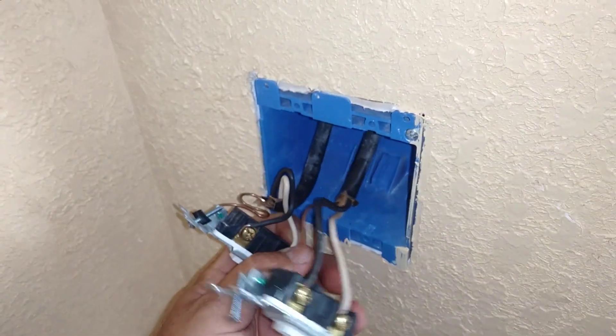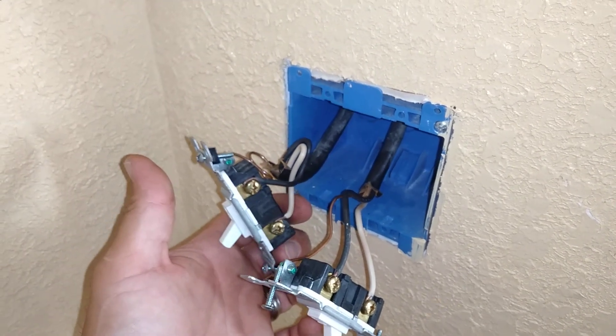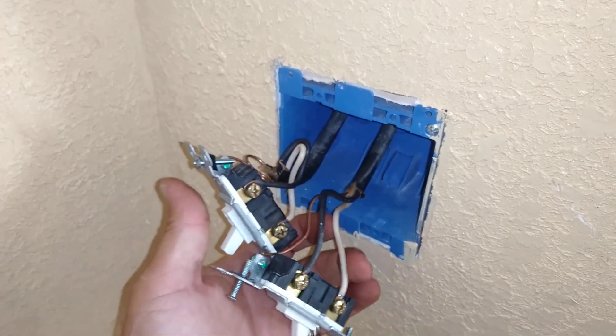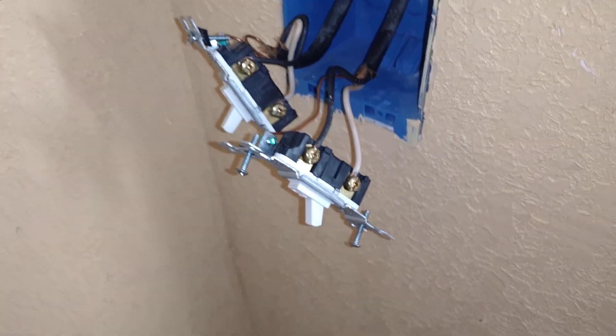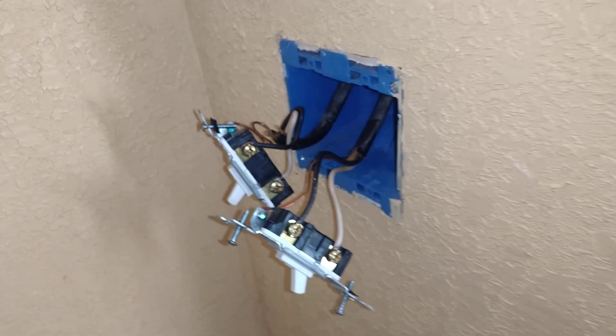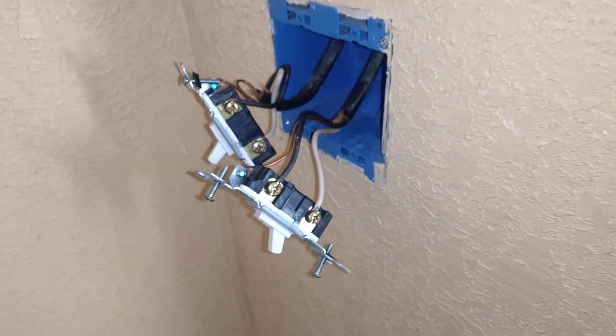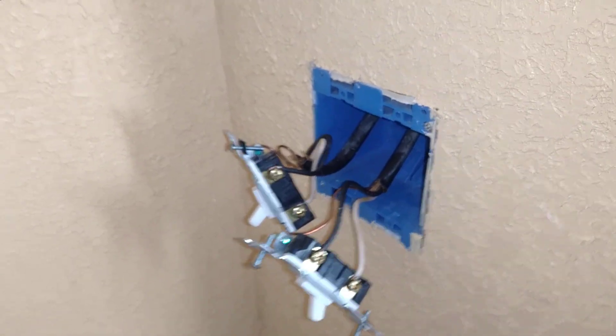Your hots are the neutral — it's reversed, really. There should probably be some black tape wrapped around there to let an electrician know that that wire is actually live. But anyways, that's what it is. Just want to let you know that if you're seeing this, don't flip out and think that somebody's done spaghetti wiring in your house — it's actually the way it's supposed to be in these older mobile homes.